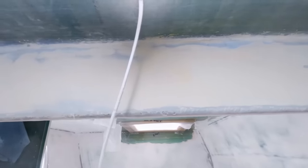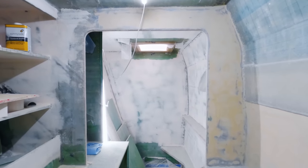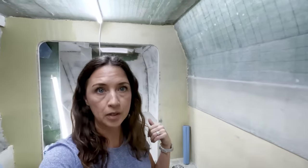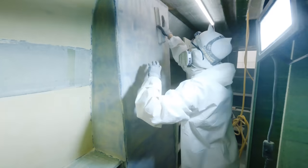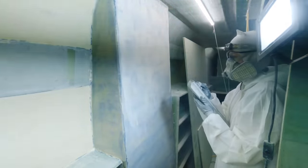At the very top a lot of blue dye is still remaining and those areas will need to be filled. Aside from a few random spots, bulkhead 4 is looking very fair and only needs minimal attention — just a few swipes with more compound at the top and bottom and another run through with my sanding block. Using the denatured alcohol with blue dye has given me a really good idea of how these bulkheads are going to turn out. The daggerboard case still needs work given the 11 layers of glass that went on there, but I think this technique is going to help me get the whole boat primed and painted.